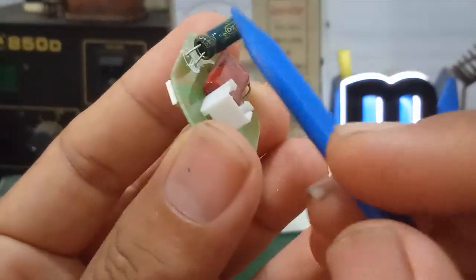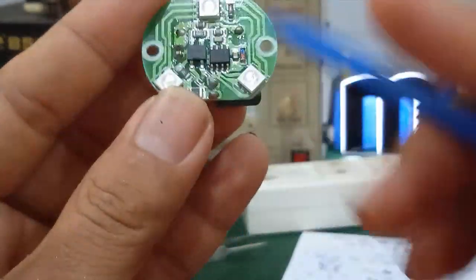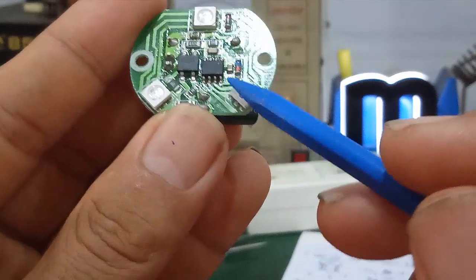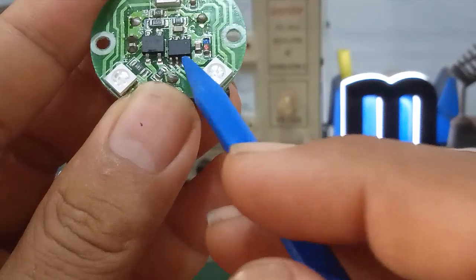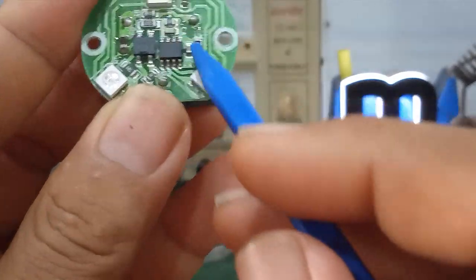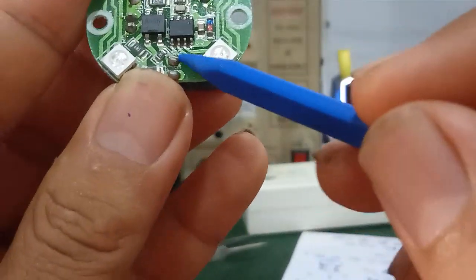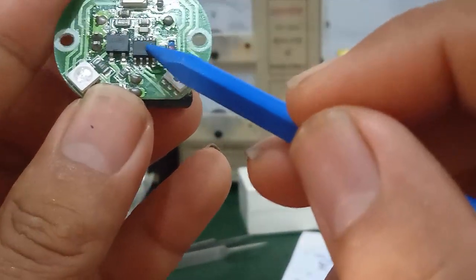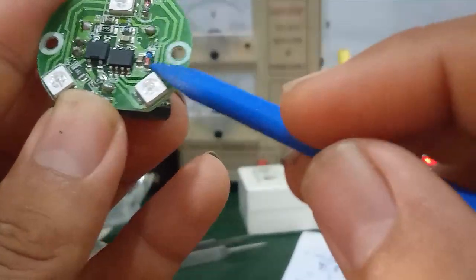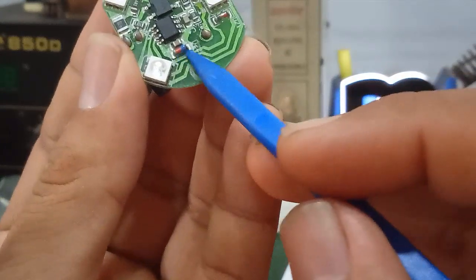This is the electrolytic filter capacitor. After stepping down the voltage to a DC level, it supplies power to the IC LED driver which controls the LED colors. Because this power supply output can be around 12V DC, the IC here operates at around 5V DC. There is a zener diode here regulating to 5V.